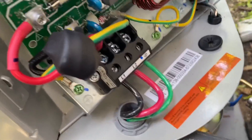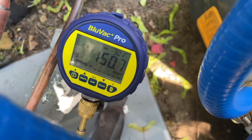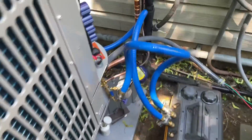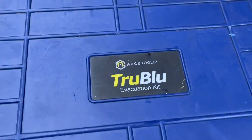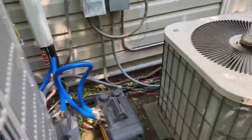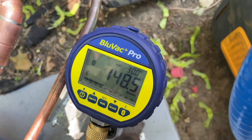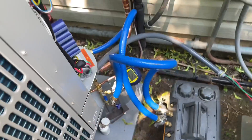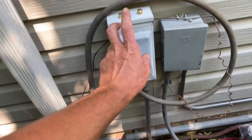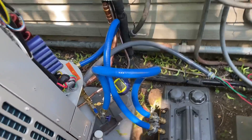While I'm working on the electric, I've got my vacuum running. I'm using the Eco-tools True Blue Professional evacuation kit and the Field Piece 8 CFM vacuum pump. You can see I'm at 148 microns just after about 20 minutes. I'm going to change out the disconnect, let it come down even further, and then we'll do a decay test to see how she's working.